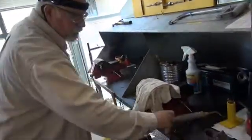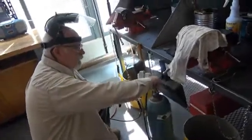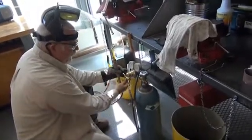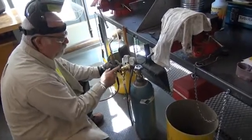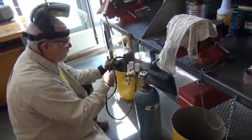While it's cooling, be sure that you've got your gauges shut down. Shut off the main valve, then shut off the tank valve. Now drain what's in the hose, then back off the valve and disconnect the hose.